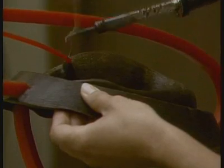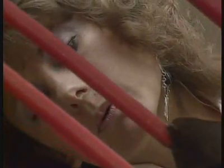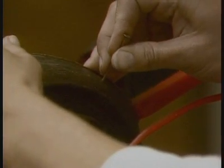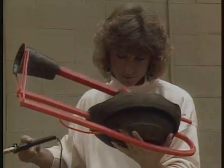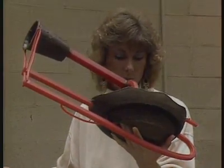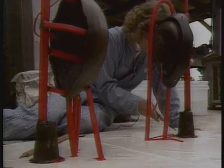High points are vented to keep air pockets from forming. Core nails are inserted through the wax. These will hold the investment core in place when the wax has been burned out. Finally, I check to make sure all the joints are smooth and secure so the bronze can flow freely. The pieces will be invested with cups down, then turned over for pouring the bronze.